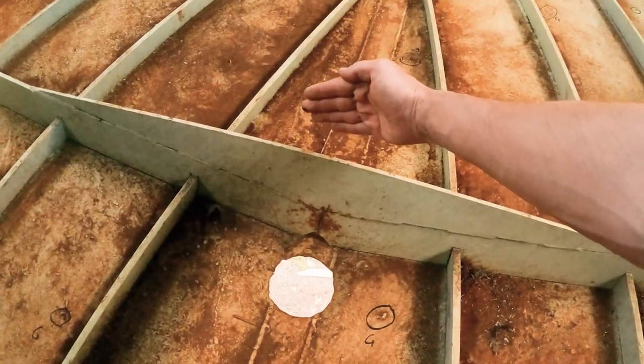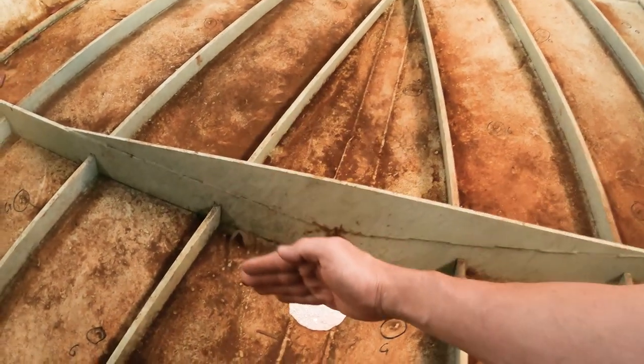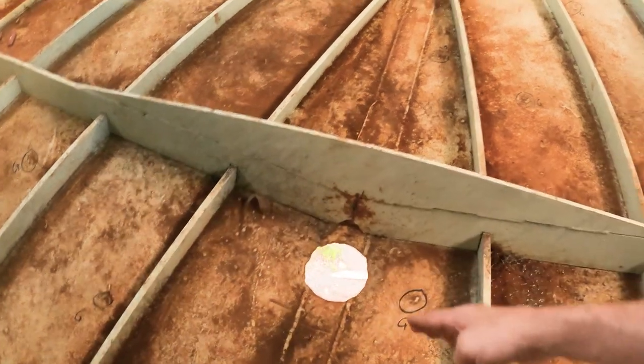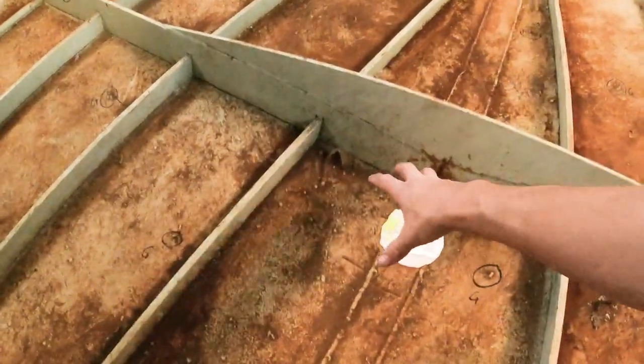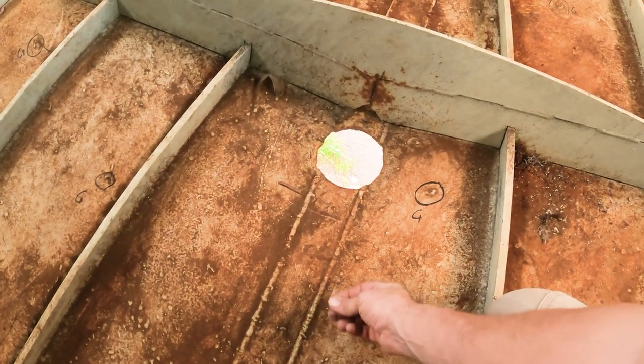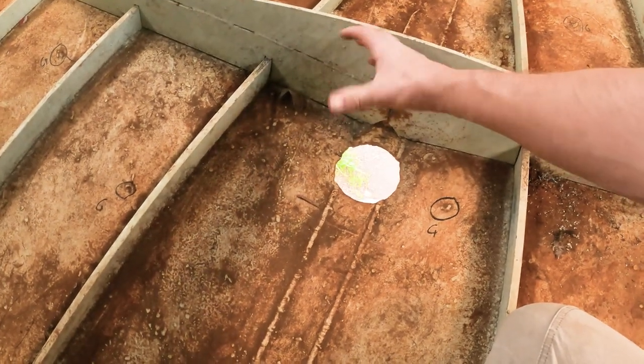With a double bed stopping there, it's only worthwhile to continue on to a queen bed, which stops just this side of the rudder box. So we can box the rudder inside the bed, which would be nice. The limitation is that as the rudder stock post comes up, it needs to be reinforced back this way - I'll have to weld a piece of steel back here coming up on an angle to that post to stop lateral movement either side. Lots to consider. I want to get all the welding done so I can start cleaning up this paint, give it a blast and a paint so it looks nice and fresh - but I don't want to do that until all the hot work is done in here.